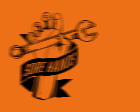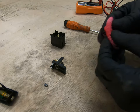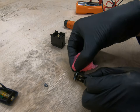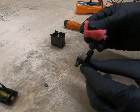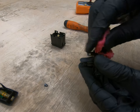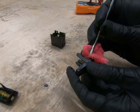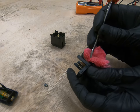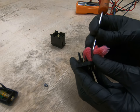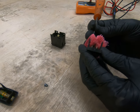I've got a small piece of microfiber cloth here and a bottle of IPA. Let's see if this doesn't clean up these contacts — just looking to get clean metal really, on all of them, all round. Just taking anything dull surface off. I'm going to try and attack this orangey stuff here using a microfiber, but driven round with the screwdriver. Go for these ones in the middle. So we give it the best chance we've got at having this working a bit more reliably.